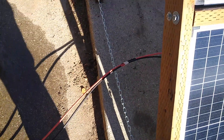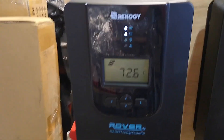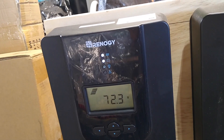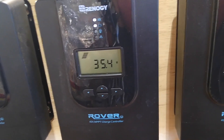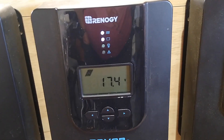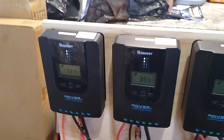So how is that affecting the energy going into the batteries? Let's check this out — I think some of you will be surprised. For the array that is in series, we have 72.5 volts, which is what we'd expect from four panels each generating 17 or 18 volts. The hybrid series-parallel array is about half that at 35 volts. And the parallel array is about 17.5 volts. All of these are numbers you would expect.